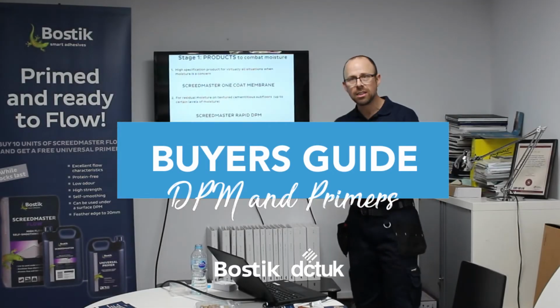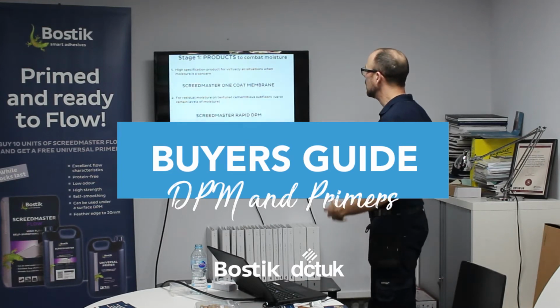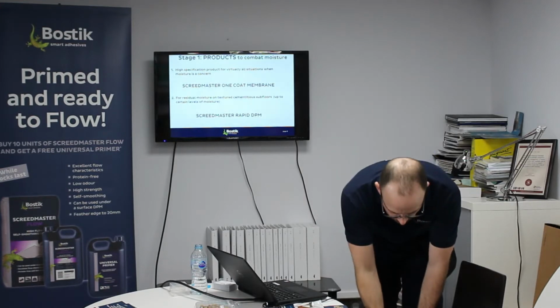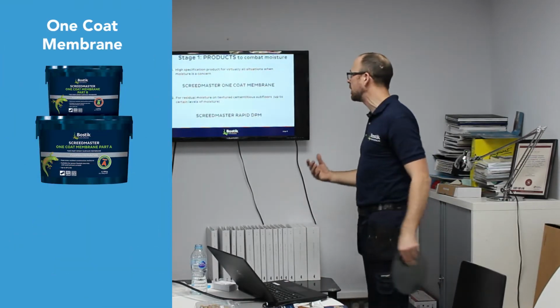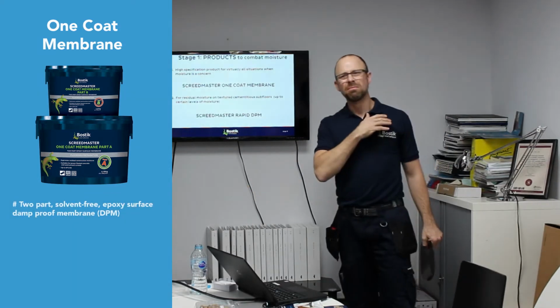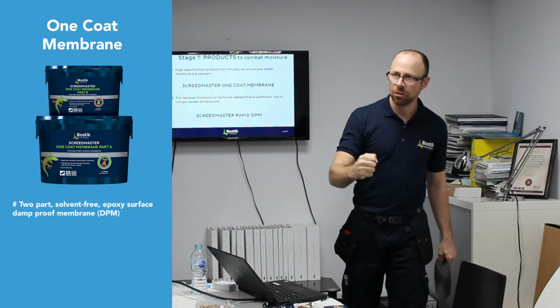What we need to do is specify the damp-proof membranes. What do we do? We've got two products. We've got Screedmaster One Coat Membrane, which is a 2-component epoxy DPM. We'd specify that every day. It's your belt and braces, and it's your surefire product.